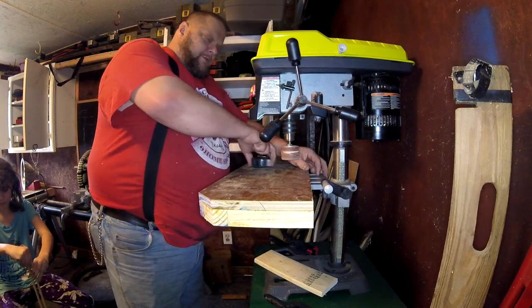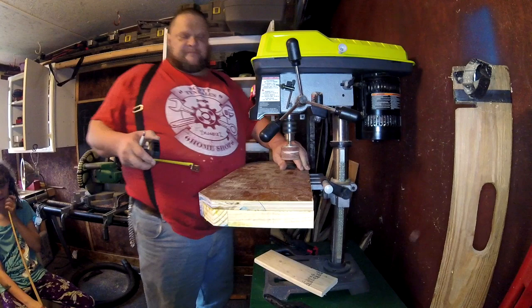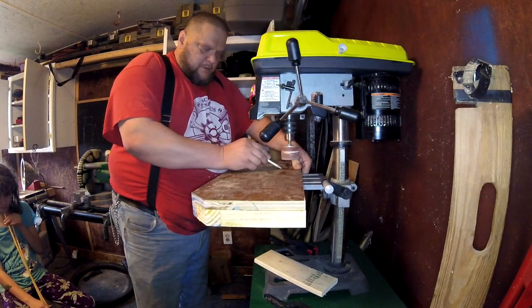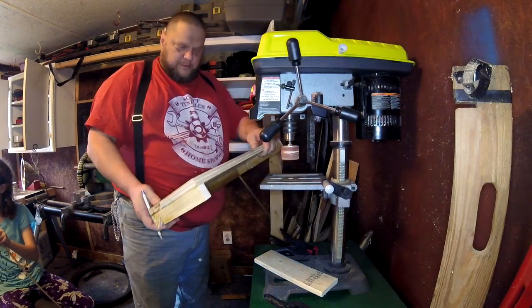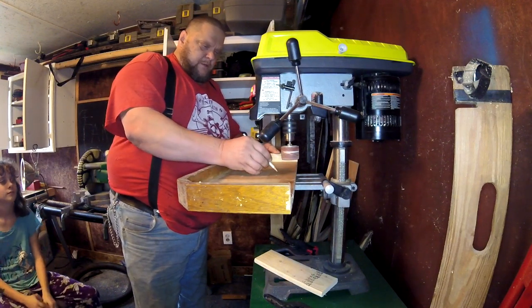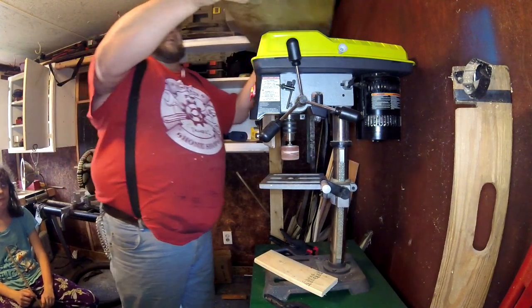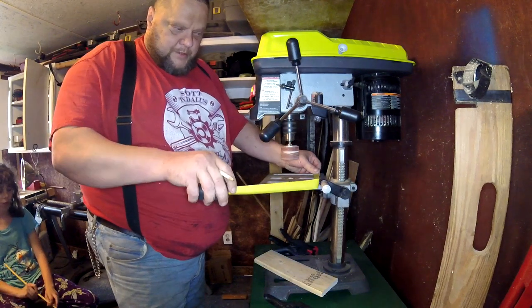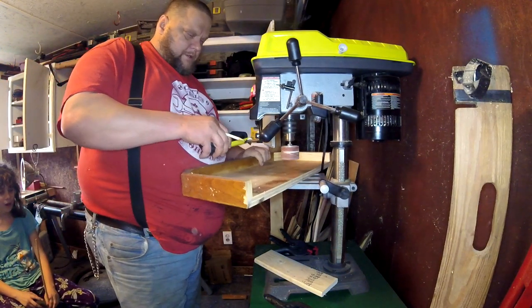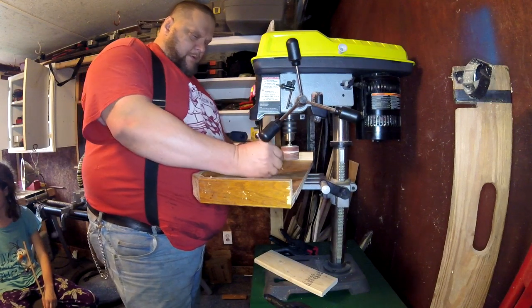So all we need to do is measure. Okay, so right there is 2 1/4. All right, and on the back, well, I'm just going to draw. Well, that didn't draw anything. All right, so I'll just do this up. 2 1/4, and then the width of the table. So let's set this up here. Now we need to see what the width of the table is, and that's 6 5/8. All right, so now we come right here and we just draw some lines here, 6 5/8, and we want these corners rounded